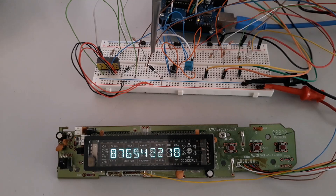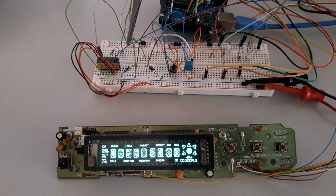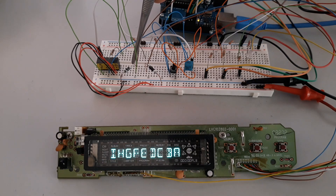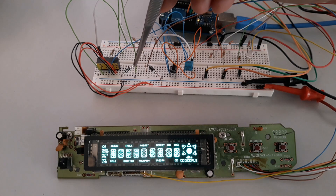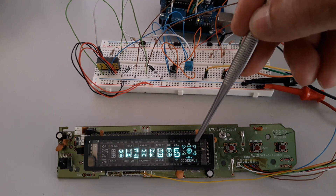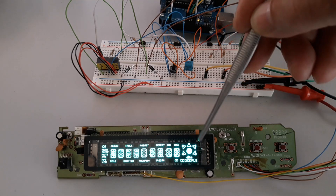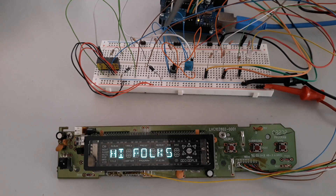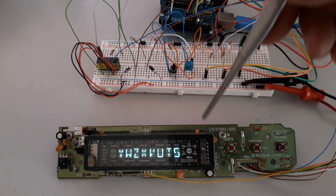These are my two wires which go to the filaments, and you can see here both diodes. This is my reference — the minus 24 volts. In this case it is connected to what we will call F2. If I change and remove it, the VFD turns off. When I connect here, you will see the shadow is more intense at this point. I turn again to F2, and the shadow is not so present here.